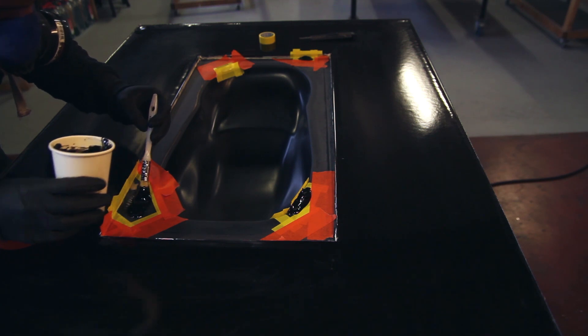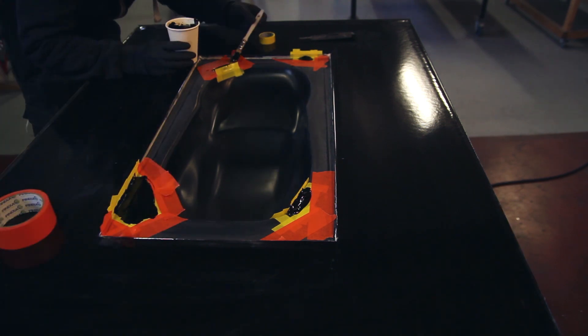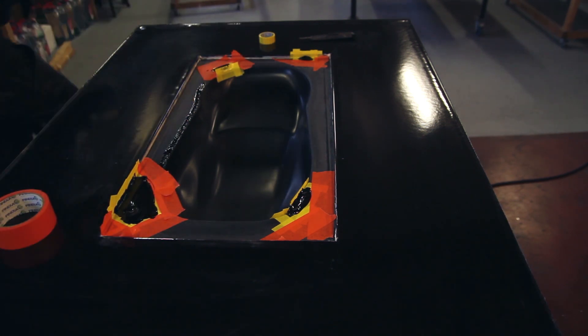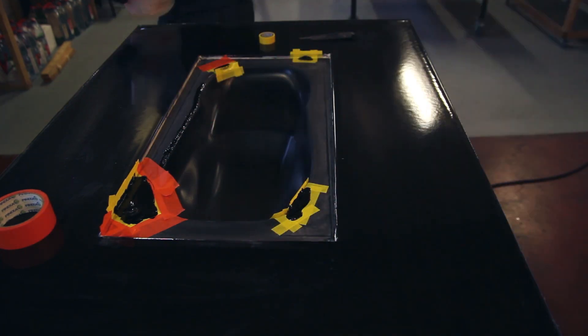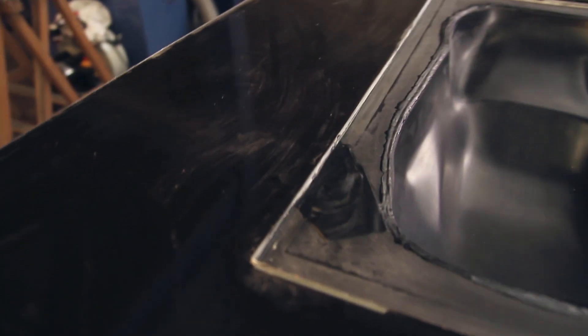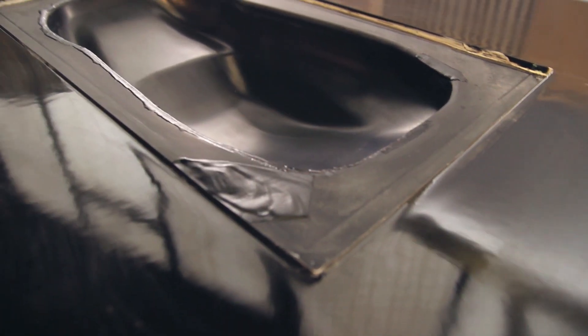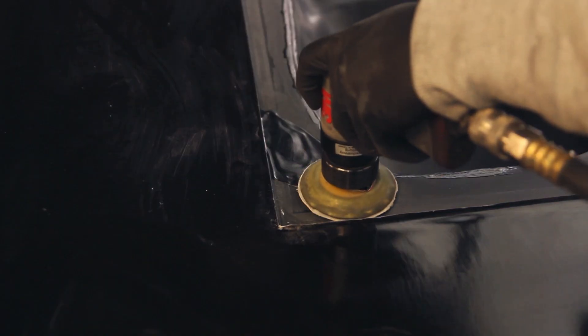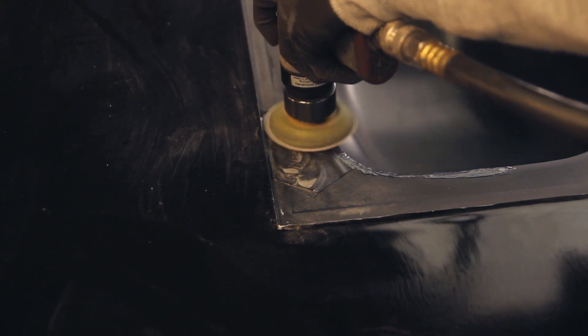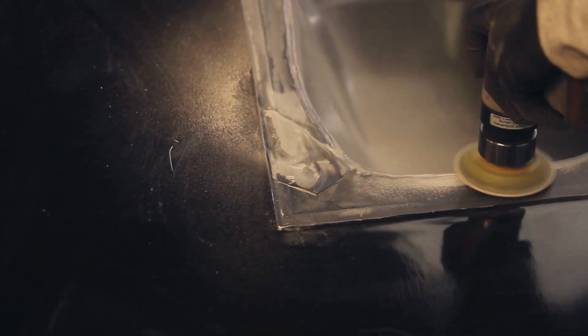Just take your time and avoid having air bubbles in it. It's not so bad to have a few areas where you sand through your gel coat, but try to avoid too much, because I've mostly found leaks through the glass fiber coupling coat behind the gel coat. When cured, it shows a dull finish — that's the wax rising to the surface, making a seal to ensure the gel coat fully cures. Another option is to use a top coat, but mostly it's good to have a good chemical and physical bond with the rest of your mold.